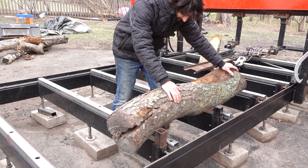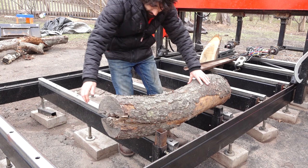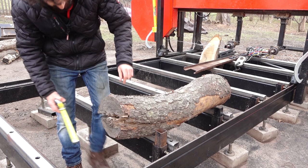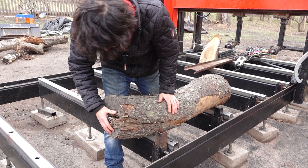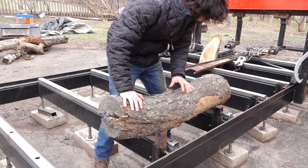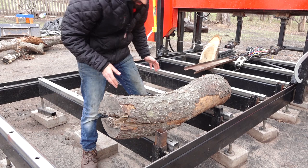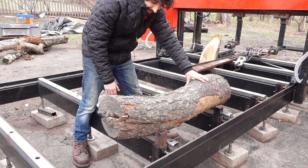This first piece is going to be one that just wants to be a slab because it's a little too goofy. One side effect of this demonstration is it should also show why curvy logs don't make good saw logs for traditional edged lumber. This first one here is a massive eight inches in diameter — this is so tiny. You can see there's a felling split in here — when it was felled, it split. There's a bend down here and then it drops off this way, and if you look from the top, it's going like this. If you really want to make actual edged lumber out of something like this, you'd have to cut right around this massive bend, leaving you with a saw log and then another saw log — just too short to really mess with.